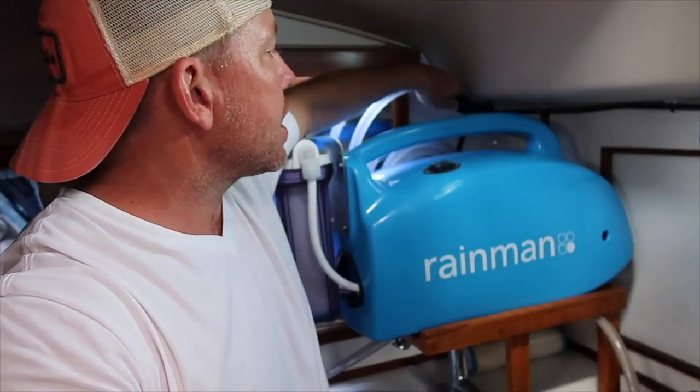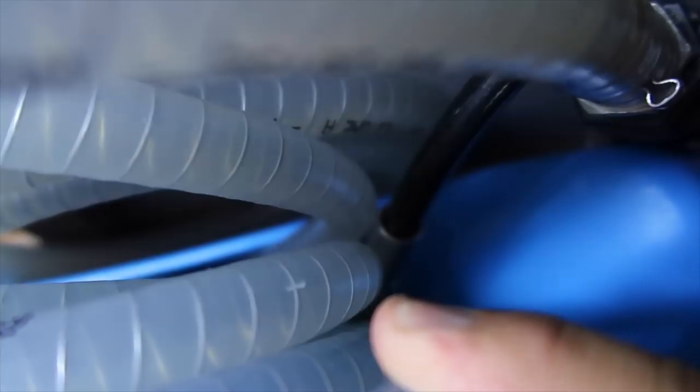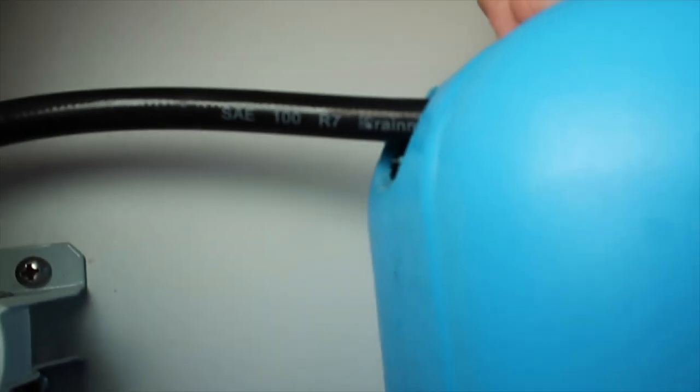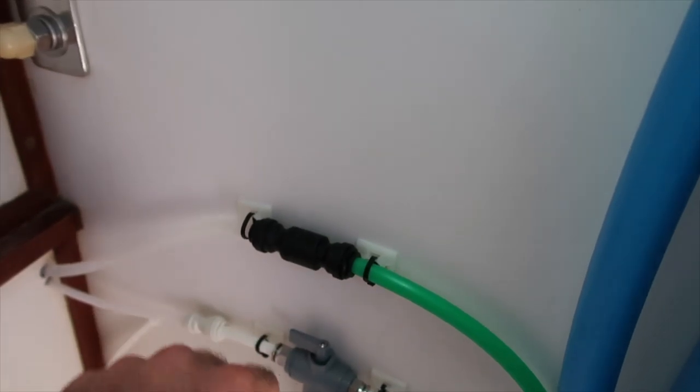From that makeshift Y-valve it goes off into the native cam connection that comes with the Rain Man. If we wanted to remove this unit, all you need to do is unplug it, disconnect it, and the unit can be pulled and brought right outside. The high-pressure hose has a high-pressure fitting into the pressure unit, and I've mounted some sticky-back bases along the top to keep it clean and out of the way into the membrane unit. At the bottom we have two outputs — the green line is our brine (waste water), which goes up through a check valve supplied by Rain Man. Rain Man sells a whole set of installation parts with their 'naked unit' — a unit with no case — if you plan to install it in the bilge or a bulkhead.